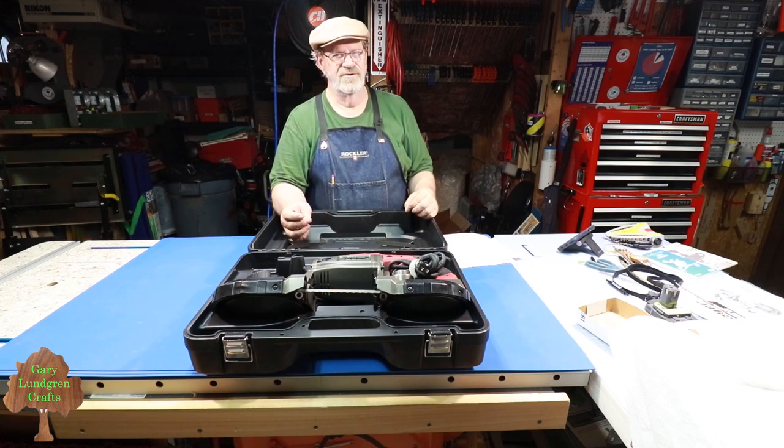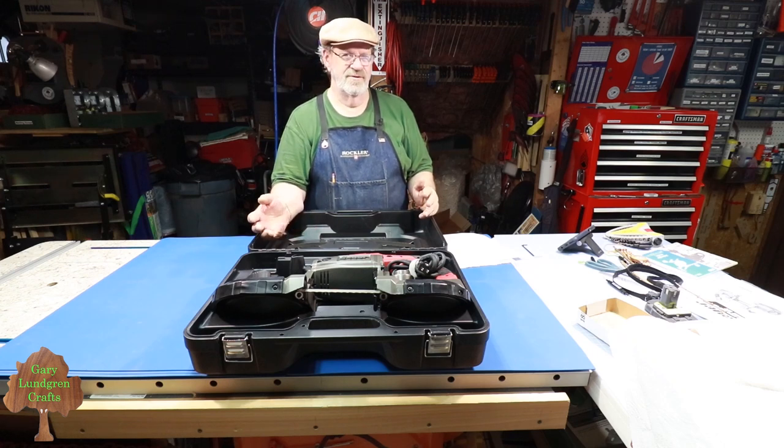The 24 TPI seems too fine for the metal cutting I want to do — it's going to take too long. The 10 and 14 TPI blades are very coarse, and for metal cutting I think that's just too rough. Those would be better suited for softer materials like wood, plastics, PVC, copper, aluminum, or brass. You can also cut a lot of those on a table saw or miter saw with carbide tip blades.